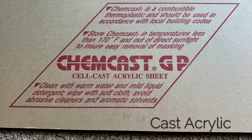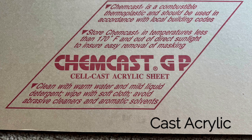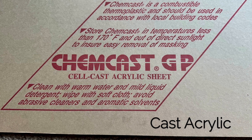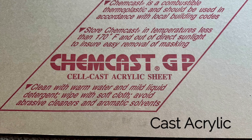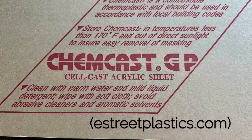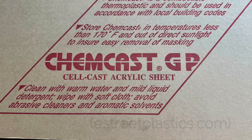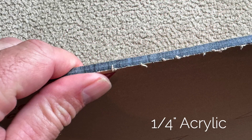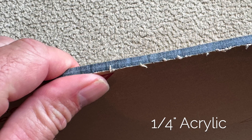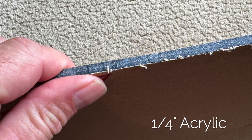The new windows will be fabricated out of acrylic, also known by the trade name plexiglass. Acrylic is manufactured using either cast or extruded processes. You want cast acrylic, since it has better clarity and stability compared to the extruded product. For thickness, I chose a quarter-inch thick material so it would more easily bend and conform to the curved cabin top.